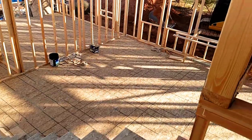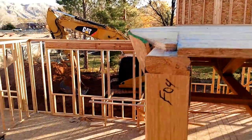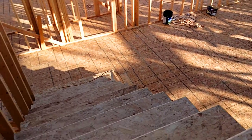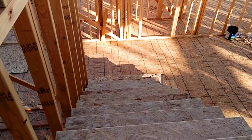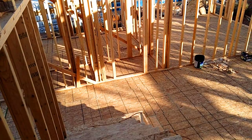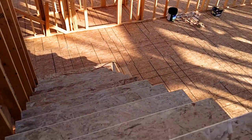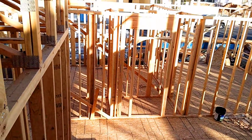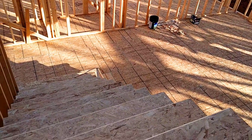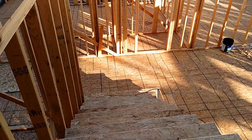Let's go over the math real fast. Take a tape measure from the top floor to the bottom floor, find the difference, and divide it by your estimated number of steps. You want that number to be as close to 7 inches as possible. If it's 8 inches, it's going to feel like you're stepping too high. If it's 6 inches, you'll have too many steps and they'll run through the wall. In this case, it worked out to 7 and 5/16 inches.